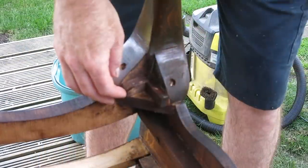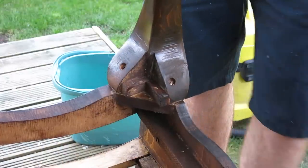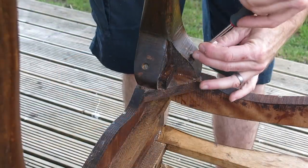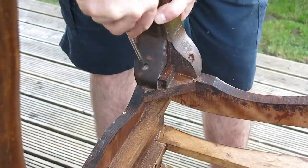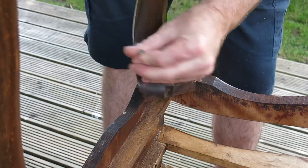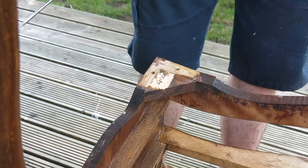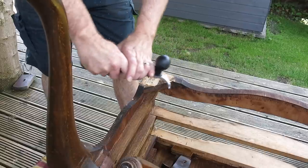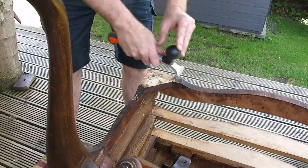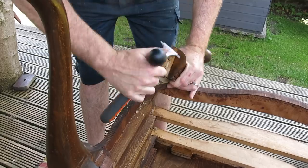This piece didn't really need a lot of attention repair wise. I did notice when I picked it up that the legs were considerably looser than they should be. On further investigation, not only were the screws loose but the actual glue underneath had just dried out and stopped working. So: remove the legs, scrape off the glue, re-glue them, re-screw them. Simple as that.